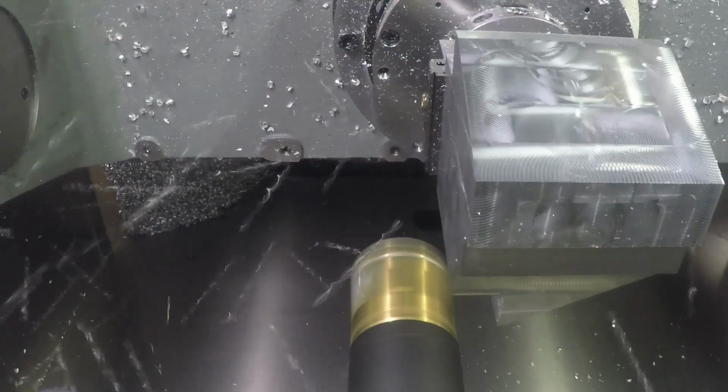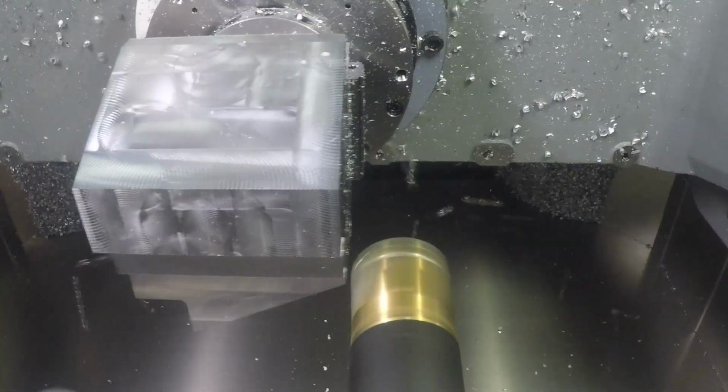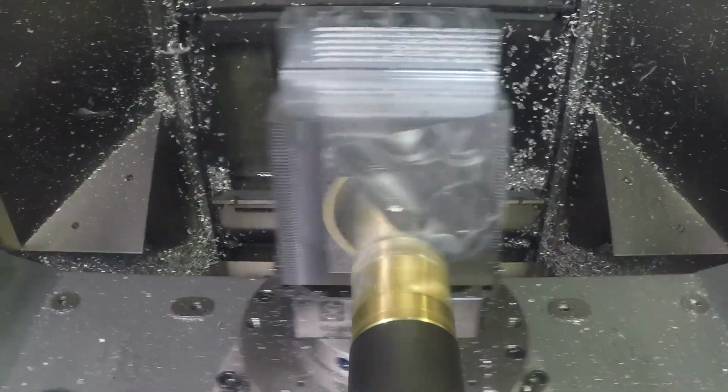And all that's integrated into one suite? Yeah, you get the CAD functionality. When you buy Tebis, you get the CAD and the CAM, so you can modify the CAD if you need to. If you're importing STEP models or IGES models that are not perfect, for example, we can repair that data, manipulate it, update it and change it if needed.